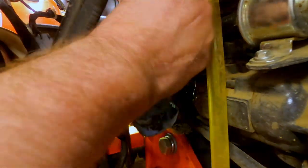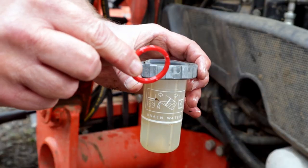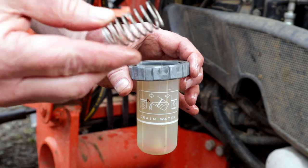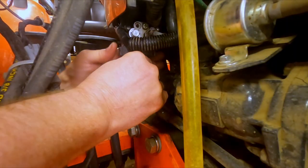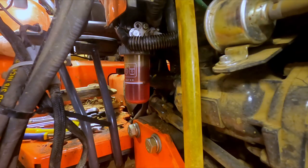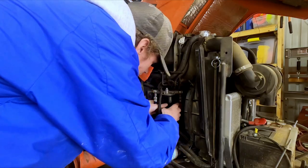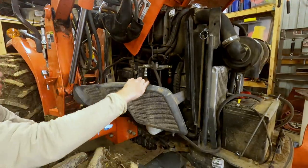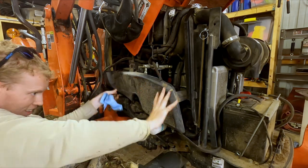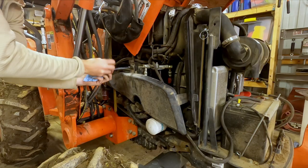For reassembly we will work back to front, starting by bolting the petcock on the machine. Once that is attached, add the fuel cup — make sure to put the components back in in their original order. Unless you have a very new fuel filter, I would also advise replacing it. Before installing a fuel filter, make sure that you fill it with diesel, or else you'll have to wait for it to fill when you prime the system, which will take a lot longer than just pouring it in beforehand.